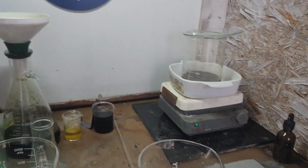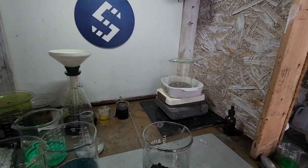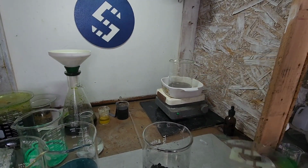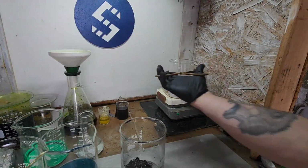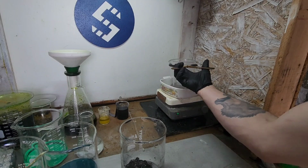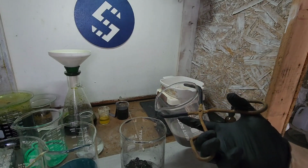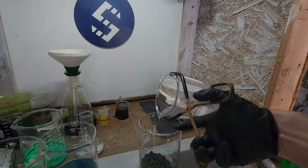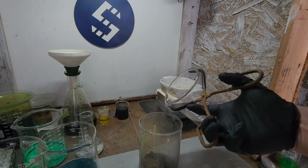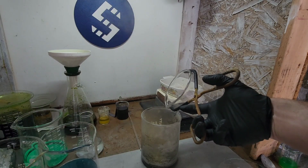Anyways, we are in the middle. Well, I should say this is the last nitric boil on the thin stuff. And I really didn't have that much reaction. I feel like I'm kind of boiling the nitric off right now. So instead of wasting that nitric, we're just going to go ahead and plop that into here. And I'm sure we're going to have a crazy reaction right off the bat, just because that's kind of the way it goes, especially with hot acids, but this stuff was pretty dilute. Little bits at a time. Make sure we don't have a crazy reaction.